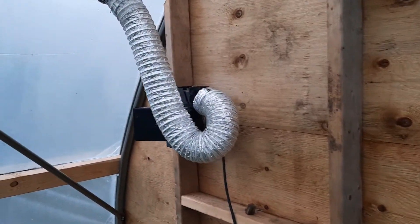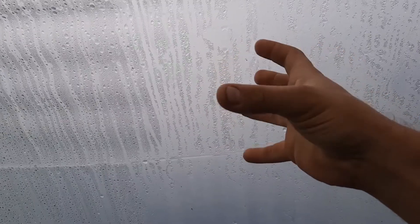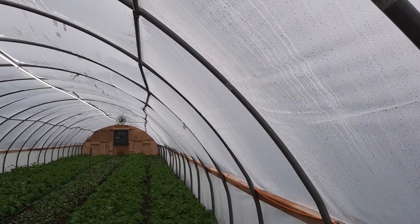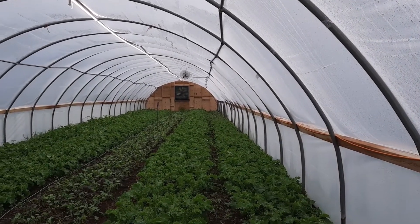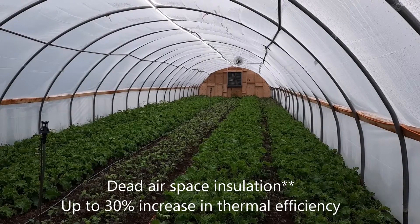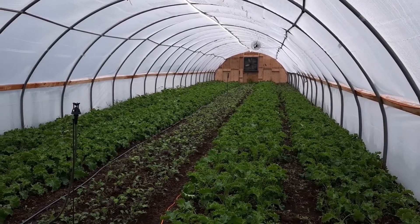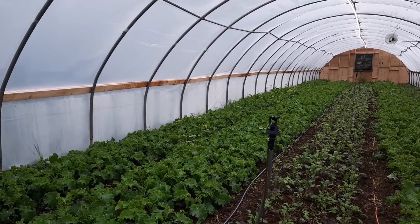Over here is an air inflator or centrifugal fan. There are two layers of plastic and it blows a curtain of air between those two layers, causing a bubble to form. You can see it takes six or eight inches before I touch the outside layer. So this whole greenhouse is essentially a big bubble. That acts as a layer of insulation without disturbing the optical transmissive quality of the greenhouse, and it reduces heat loss by about 30 percent — which makes a huge difference for winter growing.